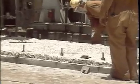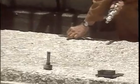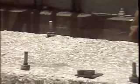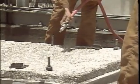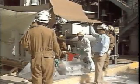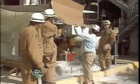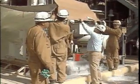The foundation must be clean, dry, and free of any contaminants such as water, oil, grease, concrete dust, etc. that could affect the bond of the Chockfast Red to the foundation. To protect the foundation and provide environmental control, erect a temporary structure around the foundation to eliminate the possibility of rainwater or other contaminants contacting the properly prepared concrete surface.